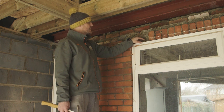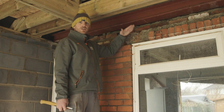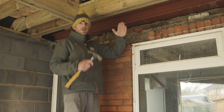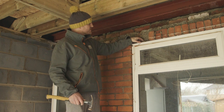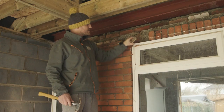Just looking here already, you'd expect a lintel above every window and door to stop any weight pushing down. And if you have too much weight on a window like this, it will stop these opening because the weight will push down and you won't have a square anymore - it'll start pushing in. Already, just from taking the first couple of bricks out, there is no lintel.